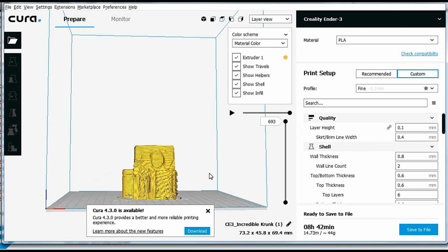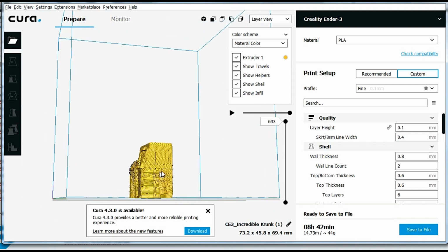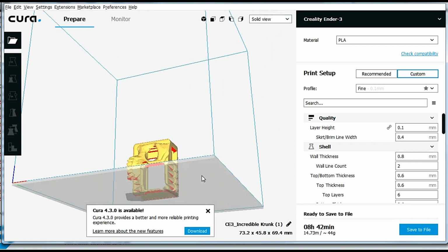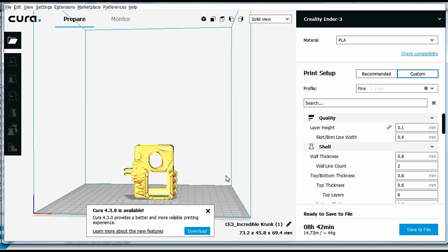Number 3 on this is when you're setting up your piece, make sure that you don't have as much support generated around the detailed areas. Like this, the detail is from here and up, so I try to stick that more towards the top. There is some detail here in the back, but it's not really going to matter all that much. And you'll get a really good TPU piece. Those are the 3 main things: your support, your infill, and your placement. And then your speeds. Look at your speeds. Make sure your speeds are low.